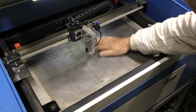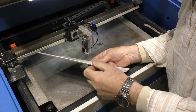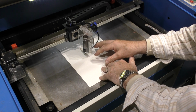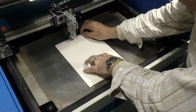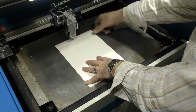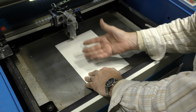Now I've got my nice steel flat base plate in here, which works extremely well for most things. But when I want to do this detailed engraving, one of the problems that happens is, even though I've got this fairly thick 1mm card, which you think would be very stable, when I clamp it down on here with magnets, as I start engraving, the paper starts to expand and do silly things. And so by the time I get to this point here in the picture, something strange has happened. Like this. The middle has begun to come up. And it can't go anywhere because I've clamped it down with magnets round the edge. So we get the middle actually rising up. And I don't know whether it's just relief of stress on the surface here or what, with all the stuff that's going on.